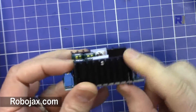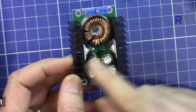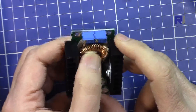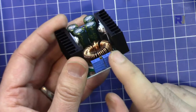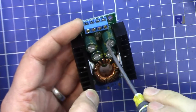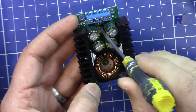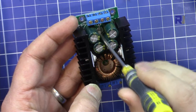As you can see here, it has very thick heat sinks — two heat sinks, two filtering capacitors, and large inductors. The voltage can be set by this potentiometer here, and you can also set a constant current. This section has an LED that shows power, and when the current reaches the constant current limit it will change color to red.